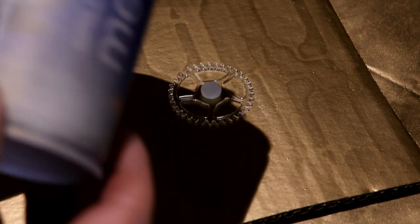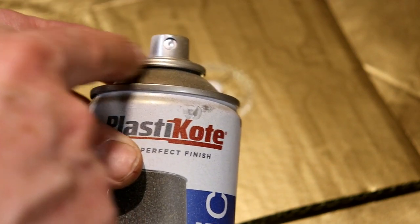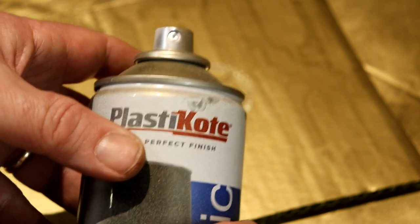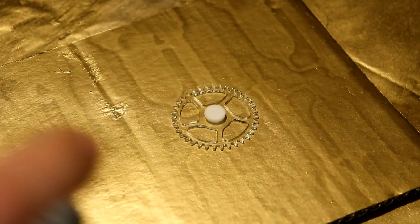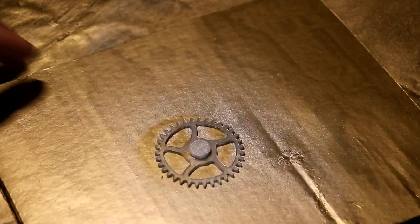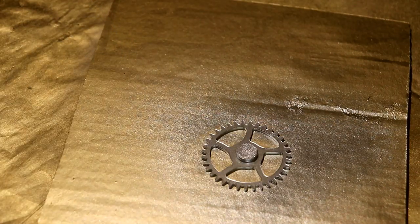This is plastic coat as well — the chrome or silver paint, really nice finish. Strangely enough though, you don't want to make this thick at all. If you use this as much as the brass paint, it doesn't dry for days, and even if you touch it after a week you'll still get your fingerprints on it. So what I've found is with the silver paint, use it really sparingly — one coat. Just not put on much at all, and again you don't have to spray the back of the gear because it won't be seen.